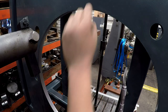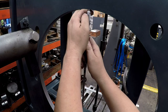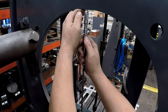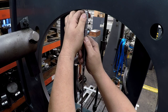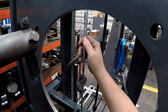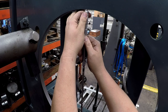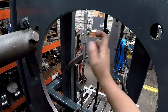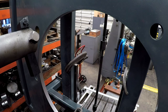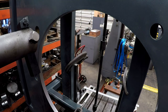I just made my last cut. I want to measure it and see where I ended up. It's not because I need to hit a certain tolerance — I was just shooting for 27 and a half inches to see where I got it. It feels pretty good right there. Looks like I'm one thou over on the mic. Good to go. This one's done — I'm going to dress the corners with hand grinders, there's a sharp burr on the back side. Time to take this one out; I've got one more to do.